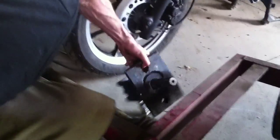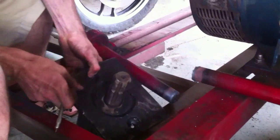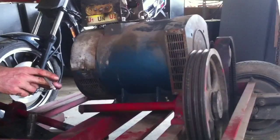So what we're going to do is mount the hydraulic motor right here, close up in the coupler. Why do that? So that the exposed shaft is much shorter. In fact, we're going to put a shroud on this and a shroud on the pulleys here, so that all the moving parts are covered for safety.